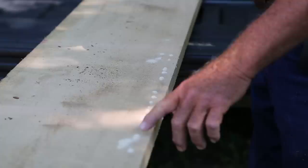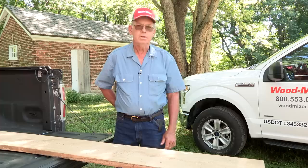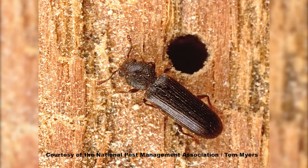It does not stop powder post beetles. What we're looking at here is powder post beetle damage, and typically what you'll see is the very fine dust that is kicked out of the holes where the insect is in the wood and boring away. It's the larvae that's in the wood that's doing the boring. The larvae eventually mature into beetles, and the beetles exit out of the hole, leaving the hole behind, and go either back into the same piece again or somewhere else to continue to do the damage.